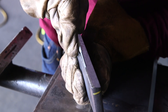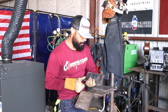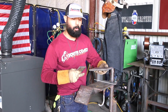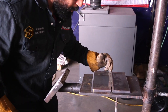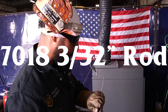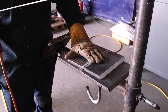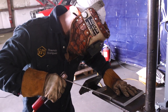Once we are prepped and cleaned, we're going to put two tacks — one tack on each corner. Your plates are going to go right next to each other, and we're going to tack at 90 amps using 7018 3/32. Small little tack — don't spend too much time in there, otherwise you're going to put a hole. The edges are probably the weakest point of your plate right now. Put your hand on there just so it doesn't go anywhere.